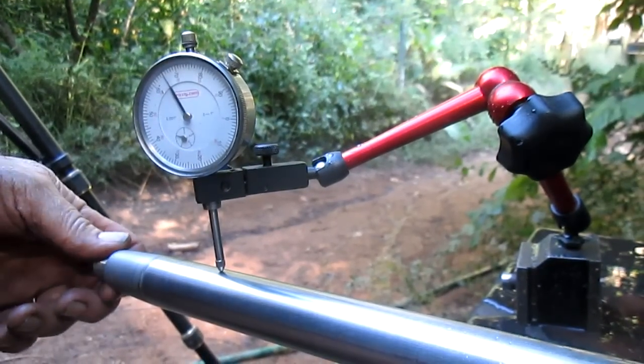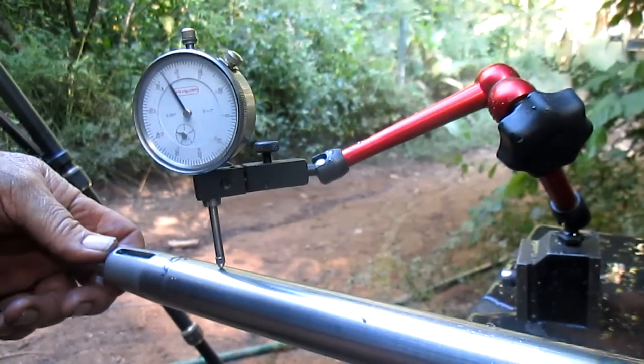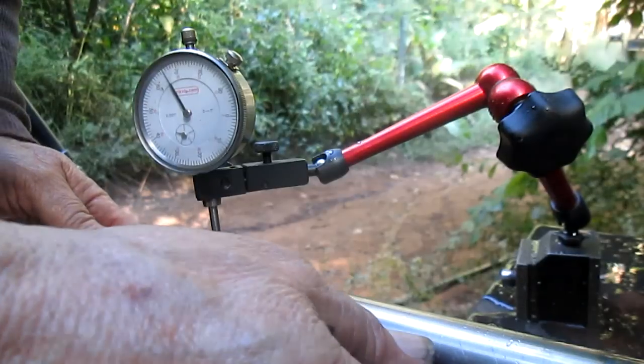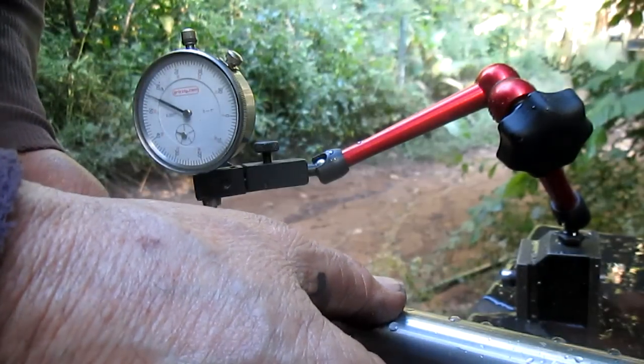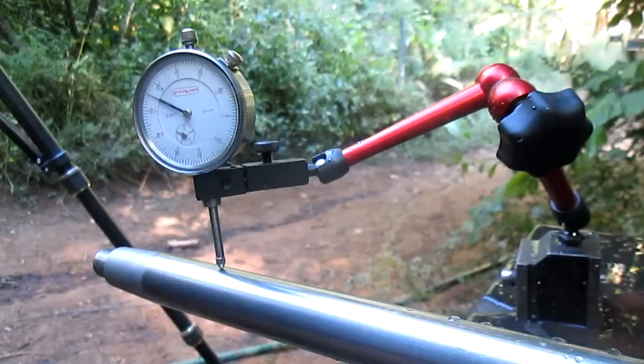All right, now we're at about 10 thousandths out, so we went the wrong way. Well, that's easy enough to fix. There it is, right there. Good. Cutting around these now and then. Check it in the shaft. The one that's standing there, make sure it fits.